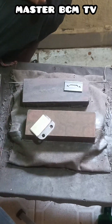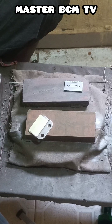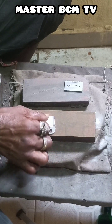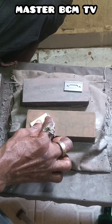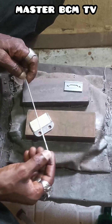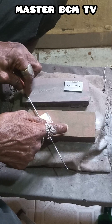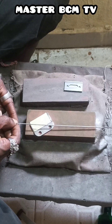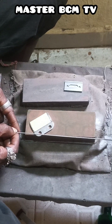Now I want to sharpen the bottom clipper blade at an angle of 75 degrees, as I told you earlier. This is 45 degrees, this is 0 or 180 degrees, this is 90 degrees, this is 45 degrees — but now I want to use 75 degrees. You see the way 75 degrees is placed. When I want to sharpen, I divide the clipper blade into two — I first sharpen one side, then use the other side. I divide the stone into three parts and use two-thirds to sharpen the first side.